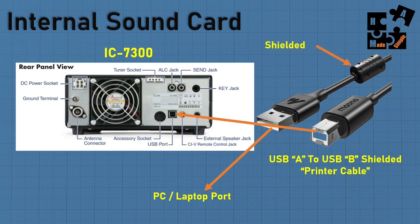However, don't cheap out. Make sure you have a shielded cable, and if it doesn't have one, put a ferrite bead on it. This is a failure point — this is where RF noise gets introduced into your system, and you'll never figure it out because you'll think, what is causing my RF noise? This cable is a prime candidate. So don't cheap out; get a good shielded cable.